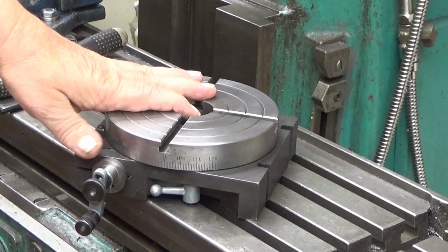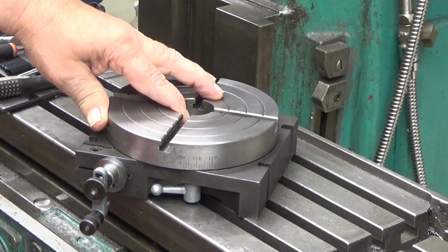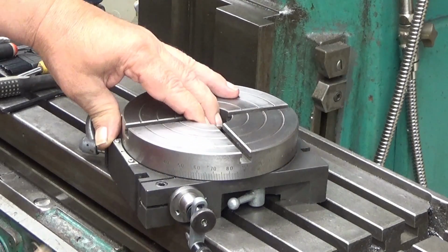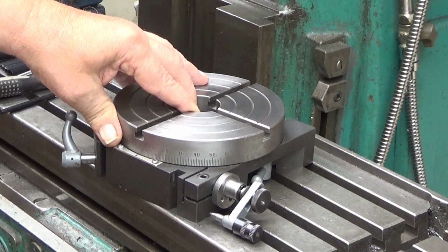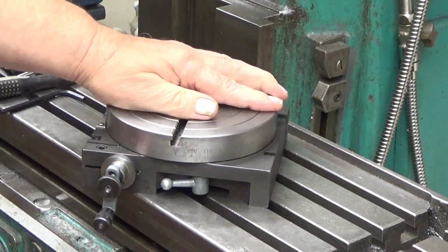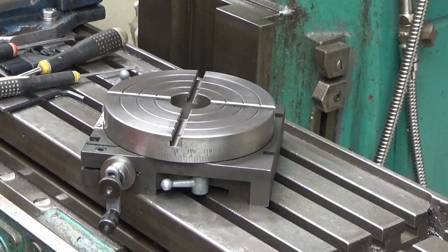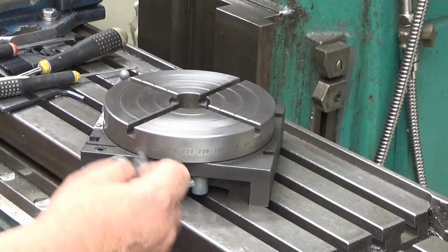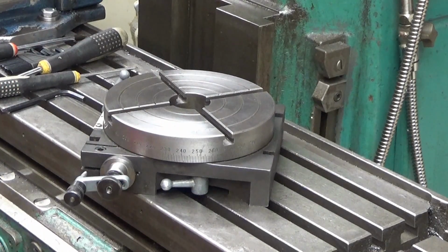And of course, when you are milling, you don't do climb milling with this one. It will strike back right away. There is about, how much is this slop here? It's 1 degree of backlash. Well, it's pretty normal for these type of turning tables. So that's one. Now you can rotate it however you wish, and make those round formations on your workpiece.